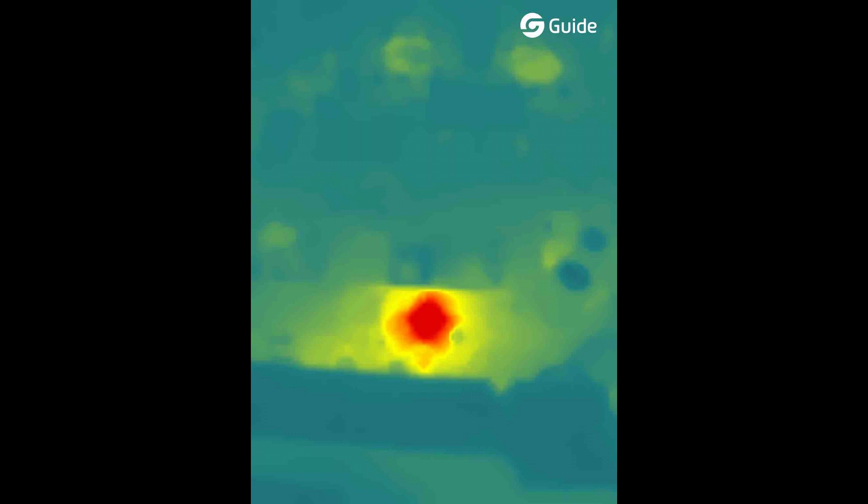So I took a picture of this area and found a fault. Here's the thermal image, and we see a hot spot at the bottom there. And then we see a couple little dots at the top here — I'll mark them with some asterisks. And those are actually the two final amplifiers, the final transistors, so they are getting a little bit warm. They're pre-biased, so they get a little bit warm. But it certainly is — there's a hot spot there at the bottom.